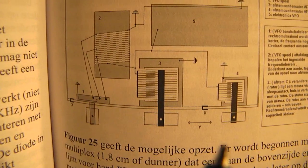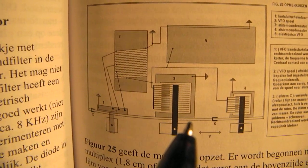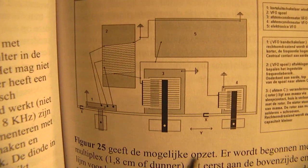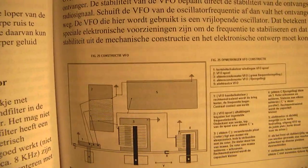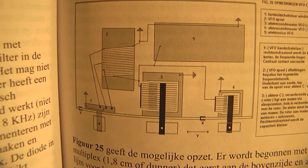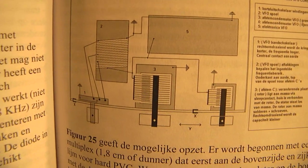It's very important that the axis from the tuning capacitor is mounted to ground. So the variable plates — the moving plates — are connected to ground, and the stator, the fixed plates, are mounted to the coil. The reason is that when you reverse that you get the hand effect: when you bring your hand near the tuning capacitor, it changes its capacitance and the radio detunes, going off the station you want to tune in. That's the hand effect — a very strange and unwanted effect.